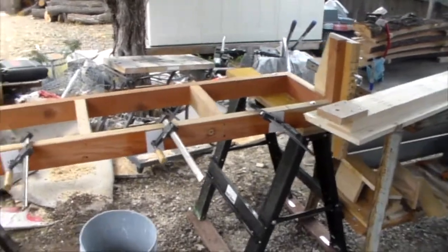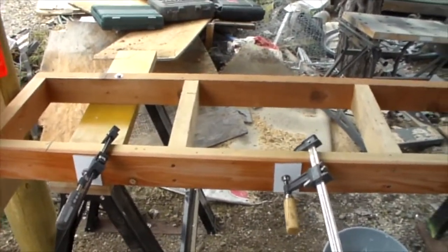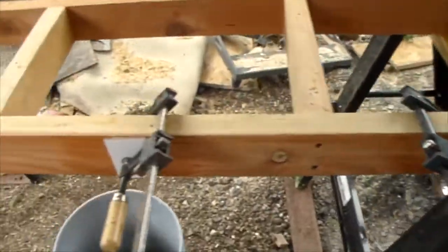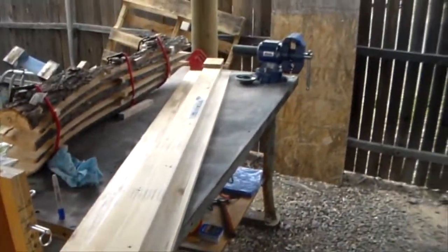Okay, there is the 4 pieces of plexiglass, contact cemented on there. And the reason I went with plexiglass, well, I had some 1/8 inch and it's slick, so I thought, you know, for raising and lowering that guide, it's not going to bind up. It should slide pretty easy on those spaced out like that. So we shall see. We'll let it set up a little bit. I'll drop the guide in there, test it out, and then we'll move on to marking where we want that angle iron to go and how we're going to fasten that.